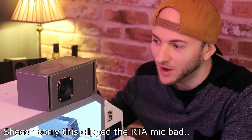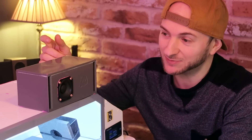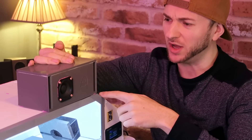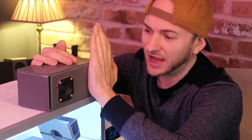At 198 Hz, there's a lot of loading on the cone — as we predicted on the impedance sweep, this is holding the cone dead still. I could put loads of power into that and it would barely move at all. It's loud and potent, and we've lost some of the harmonics — it's a lot cleaner sine wave. Before, blocking one port got us louder, but at this frequency blocking one port makes us quieter, and blocking the other one completely kills the output. So at 33 scaled hertz, it seems like we're using both ports and they're both important.